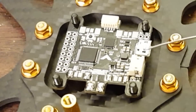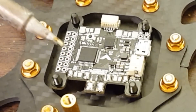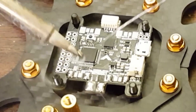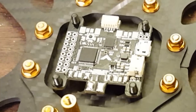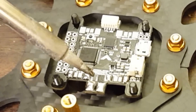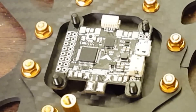My iron is a little cold. I've got it at 750, let's take it up to 800. The solder isn't really flowing on the pad as if the whole pad was getting hot. See how it didn't cover the corner here? It sort of didn't flow to the edges and wet to the edges like it should if the iron is properly hot.